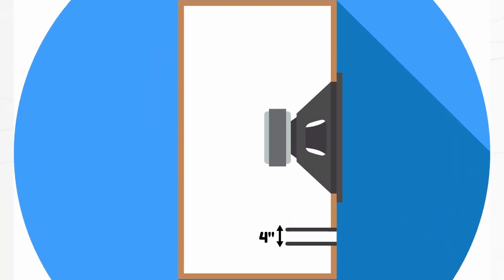I don't know what people think — maybe they imagine that the sound will escape through the port or something, but that's not how fluid dynamics work. If your port is getting too close to the speaker magnet then yes, try a different location. The port needs some clearance. The rule of thumb is, for example, if you have a 4-inch diameter port you need at least 4 inches of clearance from the end of the port to the opposite panel. If you place it behind the speaker, make sure you have at least 4 inches from the magnet of the speaker. If that checks out then you're good to go.